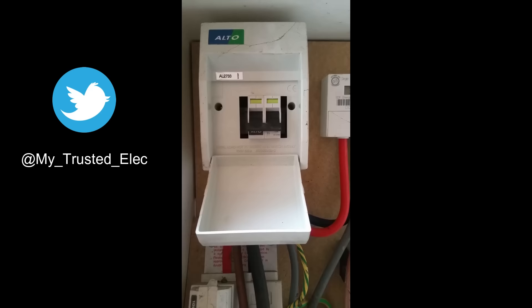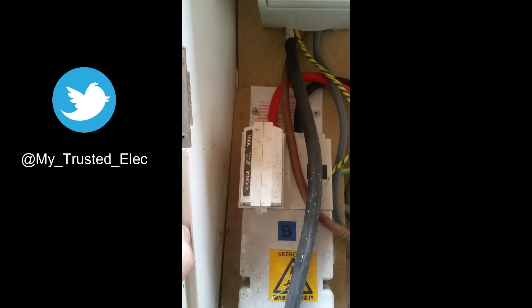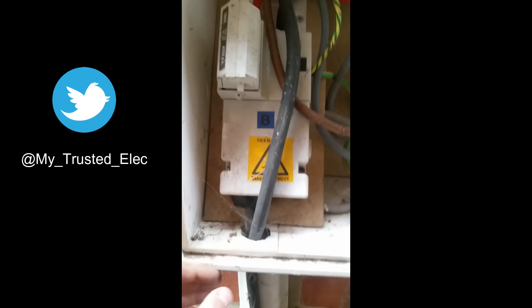So it's got no overload and it's got no short circuit cut-off. It's just an isolator. Its overload protection is going to be governed by this, which says 100 amp - could be 60, I haven't pulled it out to look. I'm not allowed to pull it out. It appears to be on a 2.5mm 3-core SWA. I think the best thing to do here is it should stay off, don't you?